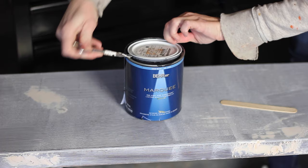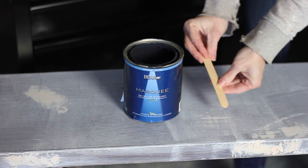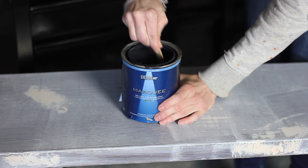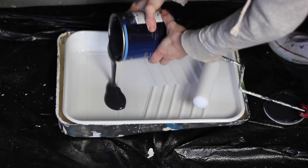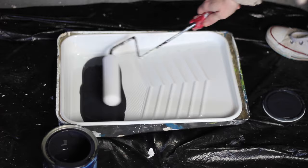Now we're going to repeat the process but this time with paint. The key is to apply multiple thin coats as opposed to one thick coat — applying thin coats and sanding in between really does produce the smoothest possible finish. My go-to brands of paint are Behr Marquis and Benjamin Moore, and for this bench I'm using Behr Marquis in the color Tricorn Black. I also typically use a satin or semi-gloss finish for furniture — the glossier the finish the easier it is to clean, which is why I never use matte finish paint on furniture, as it is extremely difficult to keep clean.